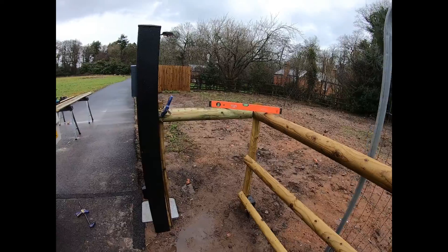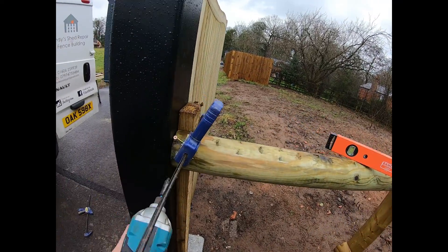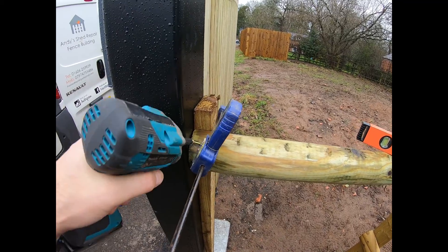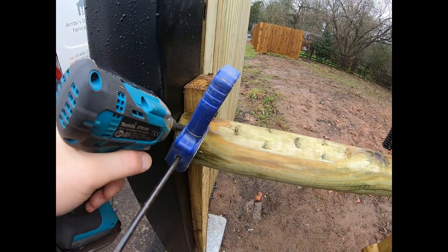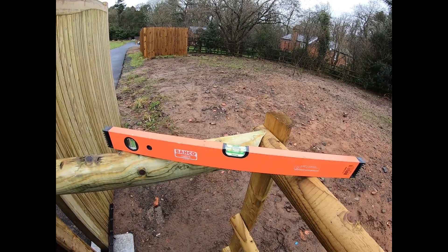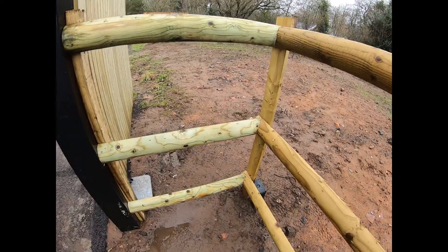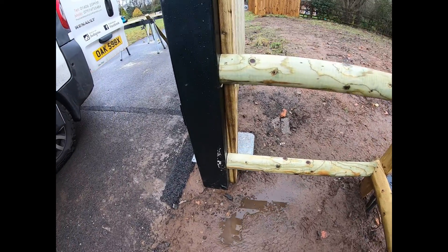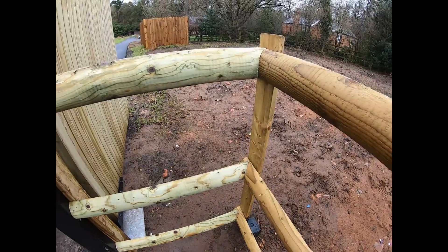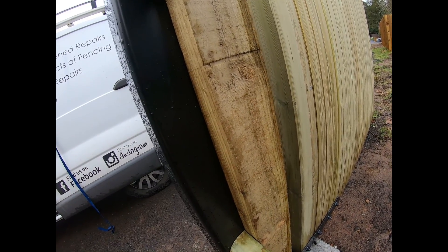Got it clamped there to the top rail. I could just get the nail gun out but I don't see the point — this is under no pressure really. So we'll just fire some 70 mil KTX screws through. That's secure on there. We'll unclamp it and do the same on the other side. So there we have it — this side done. We've got nice tight fixings in there, all good. We used KTX 70 mil screws and the self-tapping hex heads to go through the five mil steel post that holds the gate.